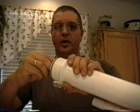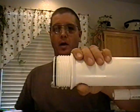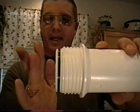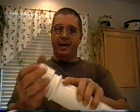It's a tight fit and it's meant to be that way. So slide the membrane in first of all — grab the plastic end and just slowly twist, and the O-rings will find their seat at the bottom and you'll slide it all the way down. You'll notice that this membrane is properly installed — the plastic end is just about flush with the end of the membrane housing. This is a properly installed membrane. Now all you need to do is install the cap, tighten it down, and reinstall this into your system.